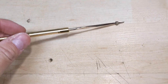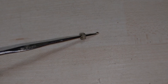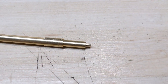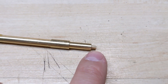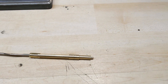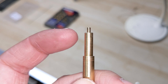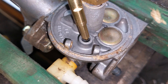Now you can bring that over to your workbench and go ahead and replace that rubber seat. We've seen how the hook end works to remove an old seat — now we're going to spin this around and have a look at the other end. This is the installation end. They've machined this piece of brass down to the ID of this rubber seat. The second stage of the tool has been machined down so that it perfectly fits the ID of that part right there.